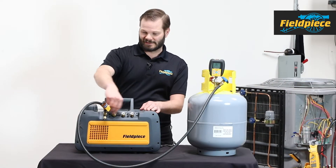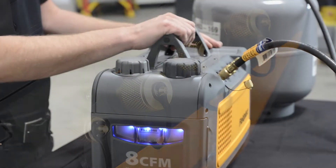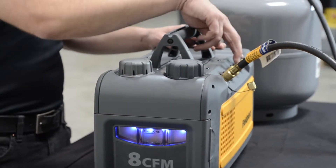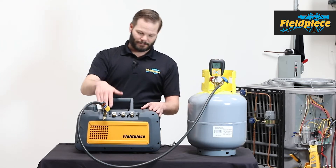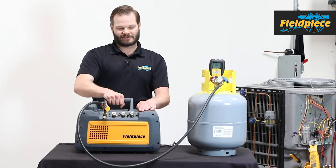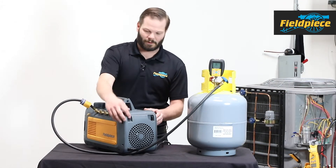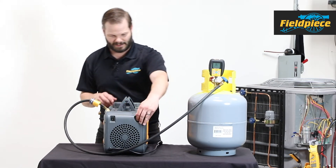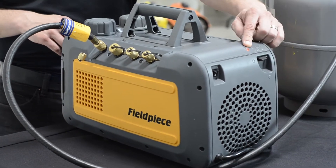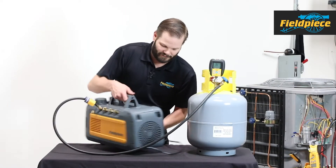The first feature you'll see on the front is we have four inline ports to hook up a wide variety of setups for your hoses — two 3/8 ports, one half-inch port, and one quarter-inch port. On the top I have a nice durable rugged handle with cord storage going along the top. On this side I have my power and my gas ballast. I can flip the gas ballast switch open, and you'll notice the red light turns on; when it's closed, the red light turns off.